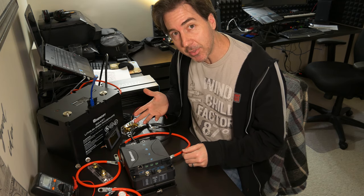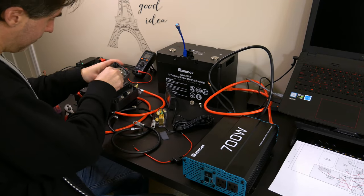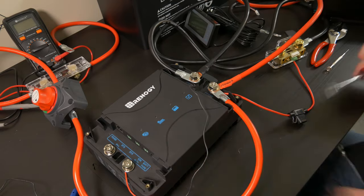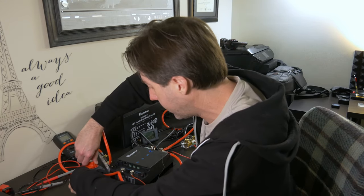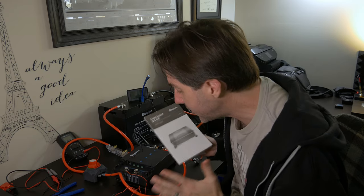It's nice and cool, so now all that's left to do is hook everything up. I'm going to set the battery type to lithium — indicated by a blue light — and switch on the battery cutoff. Hey, 13.2 volts. I've got the manual out but can't quite figure out why it's not charging. This is exactly why you hook it up on a desk first before installing it in the trailer — it pays to read the manual carefully. To charge from the alternator you need at least 13.2 volts, and my little charger here only has 12.6, so I need something with a higher voltage.